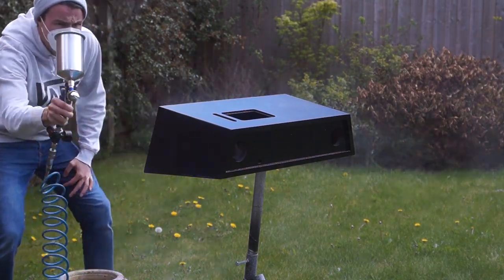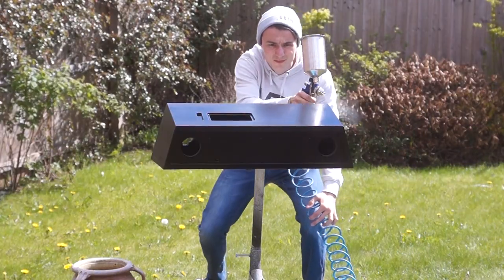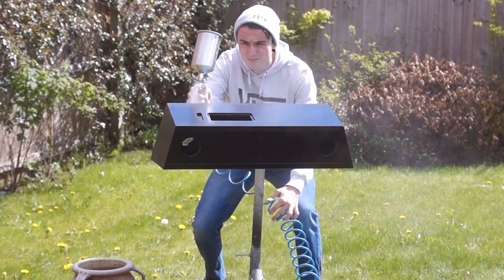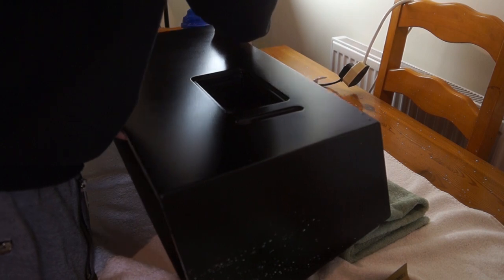So to show you how I'm doing the spray pattern, I'm spraying the gun before I hit the piece and continuing afterwards. This way you get a nice even finish. Kind of moving your arm across the whole line, but then flicking with your wrist on either side when you get to the ends.